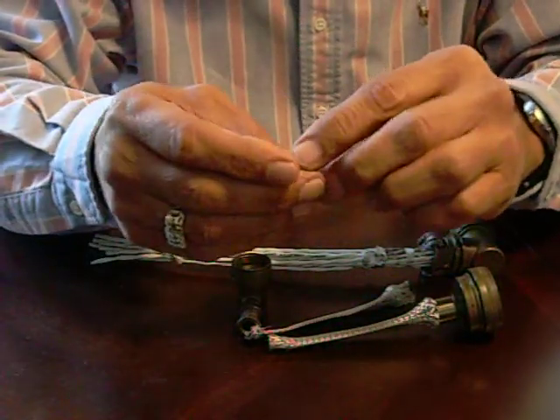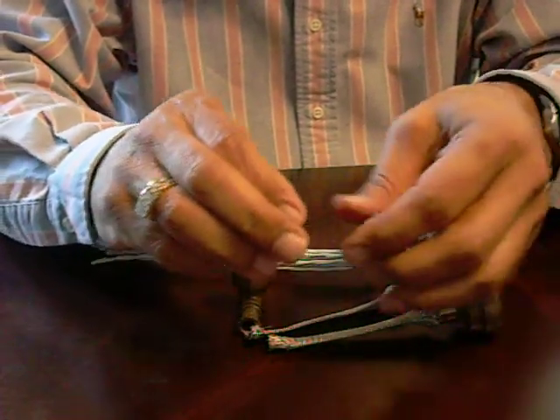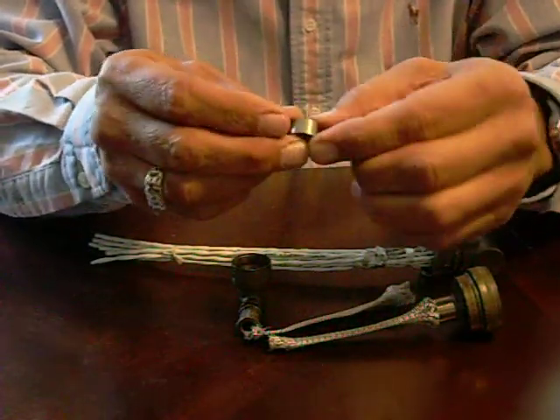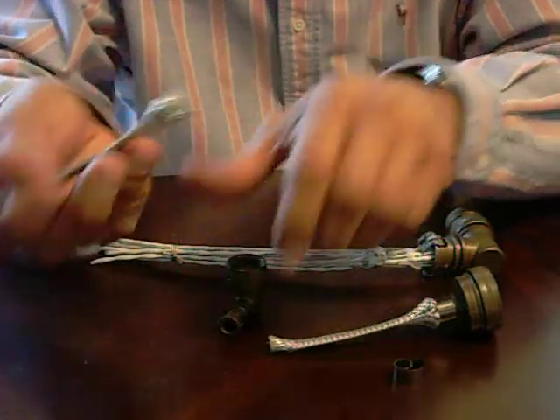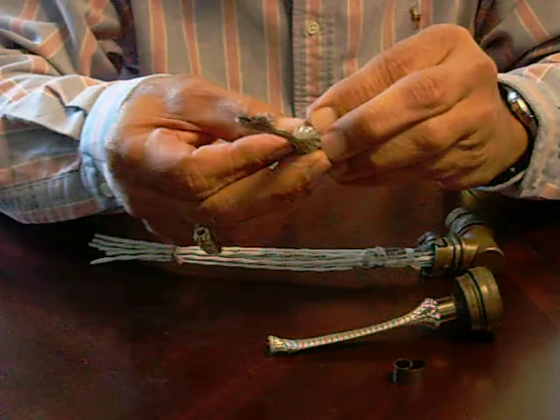To apply the braid to the back shell, you start by getting the spring clip and using the flat of your thumb — never use your fingernail. You create what we call a butterfly. Then bring your braid onto the back shell like you normally would over your wires.